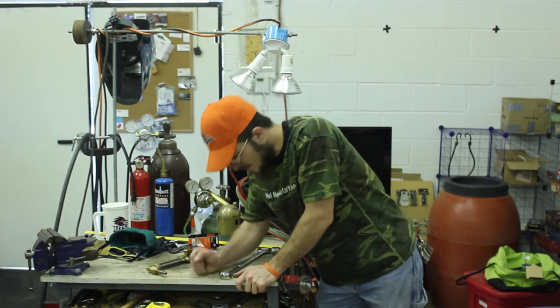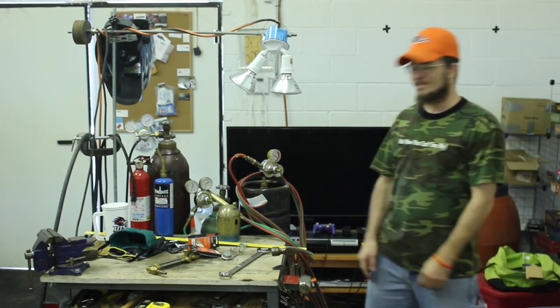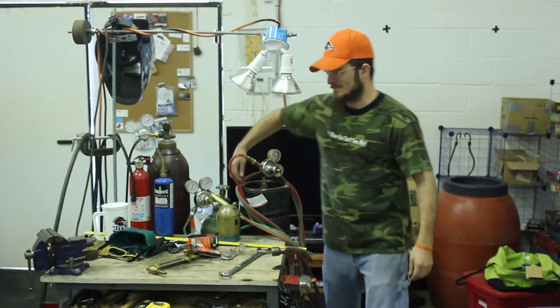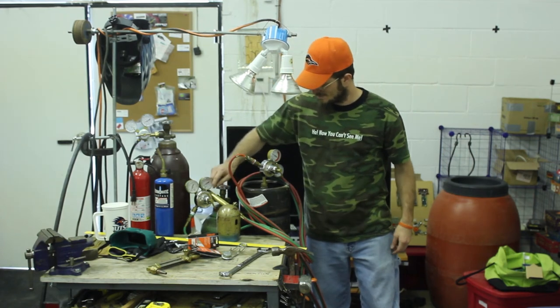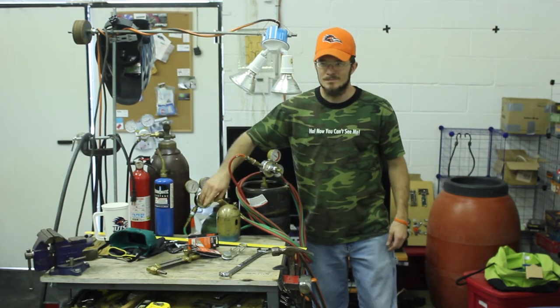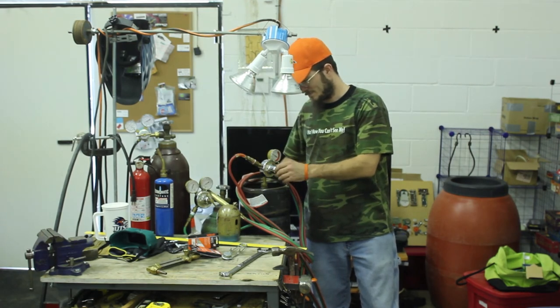Gotcha. You gotta get an arc welder, you gotta get a TIG. Absolutely, right? You know, MIG is great for light material, and with your shielding gas, you can make nice welds. When you get up to a certain size plate, you have to have a stick welder. You just have to. And then oxyacetylene is good for everything else. Heating stuff up, cutting stuff off.